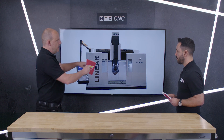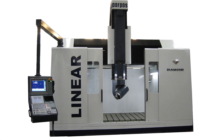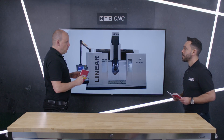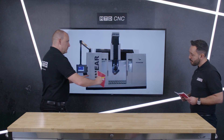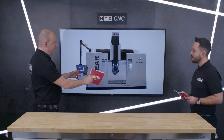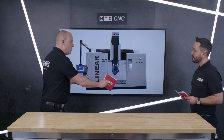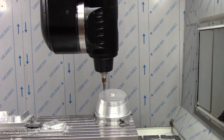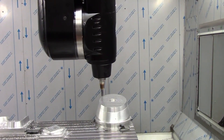The key is where it fits and who uses this style of machine. The first thing to identify, which is crucial, is how the machine is made, because the way it's made affects how big it is and what it's capable of doing. Here you can see a bridge-style design where your X-axis is moving left to right. What that means is you can have a big working envelope — if it were moving left to right you'd need more footprint for the machine. So straight away you've got a large working envelope in a very tight square, because all the movement is coming off the columns or off the head on the machine.